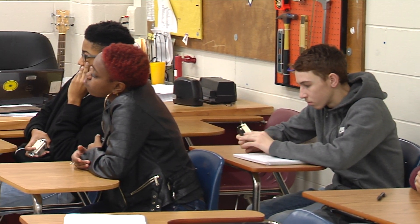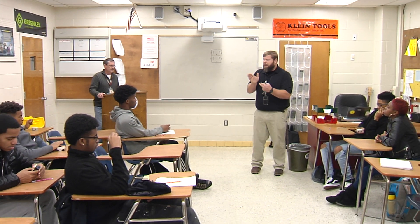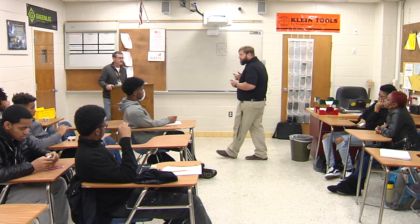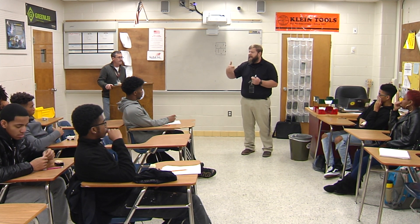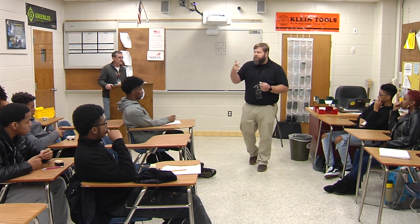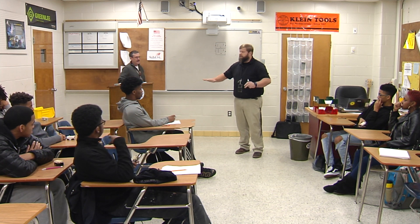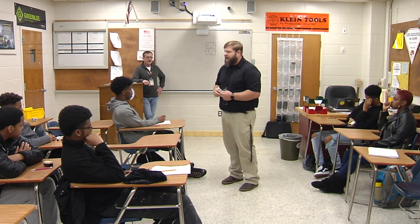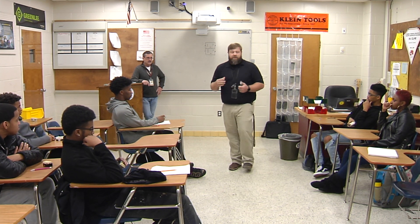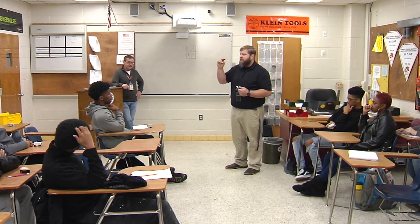How these outlets came about: a gentleman was so distraught that his daughter had died that he decided to make this kind of outlet. It's designed so that little CT, that current transformer, monitors the current going out versus the current coming back. If I have a drill that pulls 5 amps and I throw it into a bathtub full of water, that electricity is going to leak out into the water. The resistance changes, so it's no longer pulling 5 amps. As soon as it detects a difference between 4 and 6 milliamps, it shuts itself off.